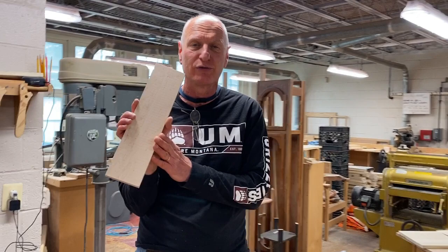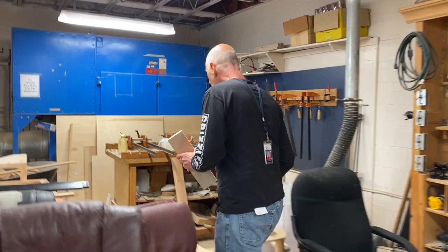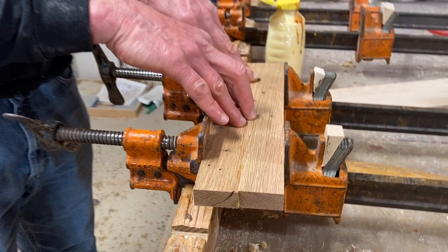There was another piece of wood that a student made a rack for. He didn't like the wormholes that happened to be in this piece of oak. It was a long piece, probably about 34 inches. What I did was I cut two pieces and I glued them edge to edge. I used the same gluing technique that we always use in here — bar clamps — and I clamped the board up about an hour ago. What I'm going to do now is break this down and send it to the surfacer to clean it up a little bit.